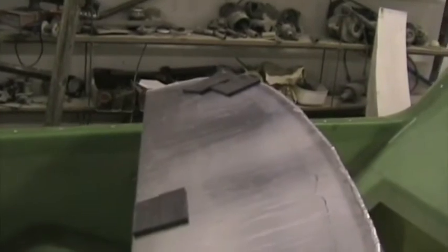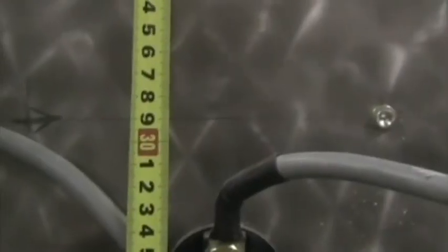That includes the engine mount bolts. You can see them there with a 3mm steel backing washer that's all been bonded to the firewall. I put anti-chafe rubber strips on the tank, as you can see there. There are the 6mm bolts holding the aluminium angles in place. The line of bolts is 290mm below the top of the firewall.